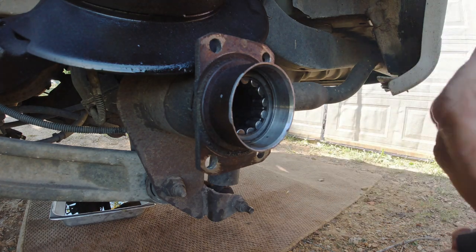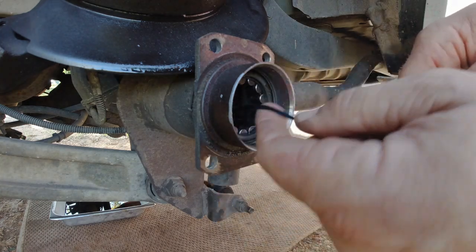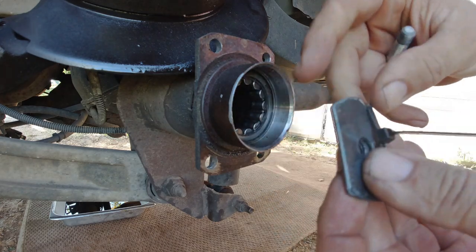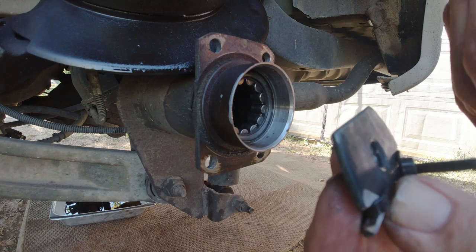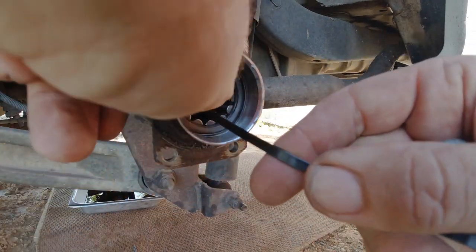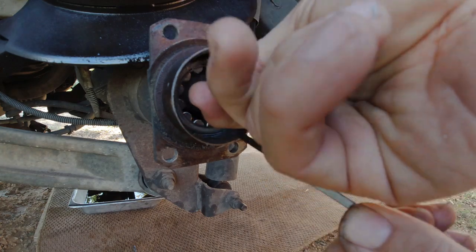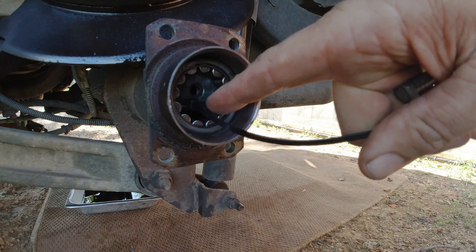Let's see how this guy works now. I'm gonna slide that in there, use this to bring it back. Looks like this thing might be a little too big - I think we've got to grind it down a little more. What's going on here is I've got to grind a little more off here and off here to make it fit, because once you get past this bearing the tube is actually a little bit smaller. So we're gonna have to grind some off on both sides, round off a little bit on each side. It's pretty close but still got to go a little bit more. You get the gist of it - now I can screw this in here, and when this is welded to that other piece of pipe I'll be able to use this as my slide to get this out. Still a little bit snug, so I think we're going to grind a little bit more off.